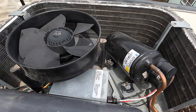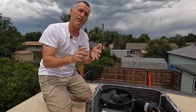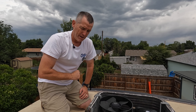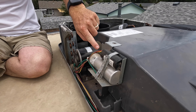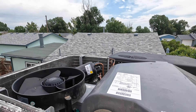We're going to pull off this panel — it has our wiring diagram on the inside, and that's crucial. You need to find a number off that panel, then go online, enter that number, and Soft Start gives you the exact wiring schematic. Before we do that, I want to show you these capacitors. Depending on your unit, these ones are sealed with no external terminals, but I'll show you how to discharge them — they carry a huge charge and will zap you badly if you're not careful.